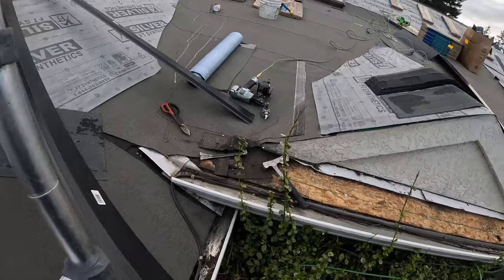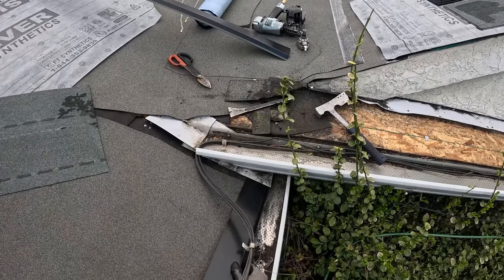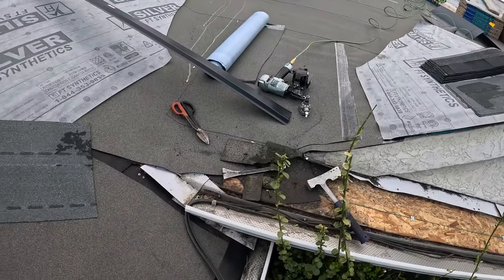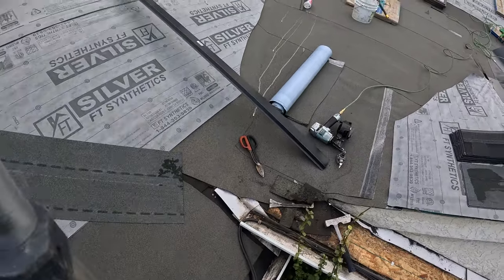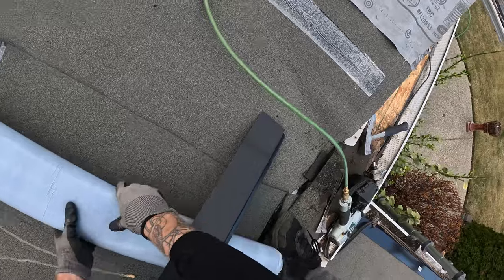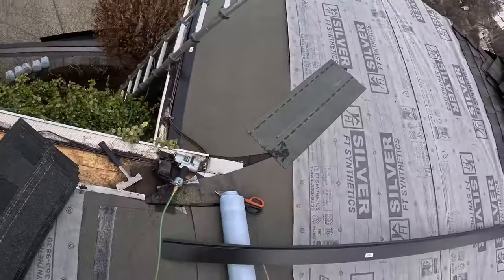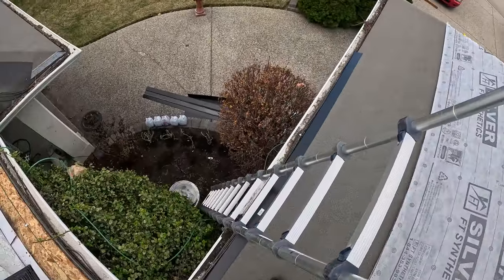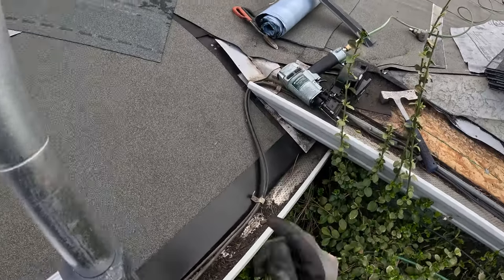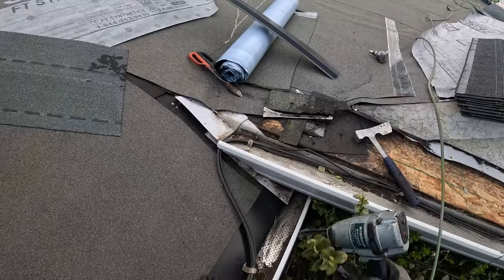If you're doing your house, there's no point in not installing drip edge — honestly the amount it costs for how much headache it'll save you. You want everything to land right, nice and tight. See how that sits on that edge there. Of course I can't reach anything now because the ladder isn't where I want it. You know if you're nailing too — anytime you nail anywhere near steps or anything, you want to keep it as minimal as possible. It's just an extra preventative measure. If you don't need to put a nail in there, don't.